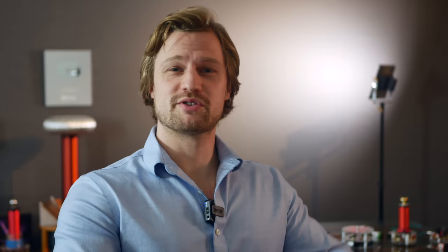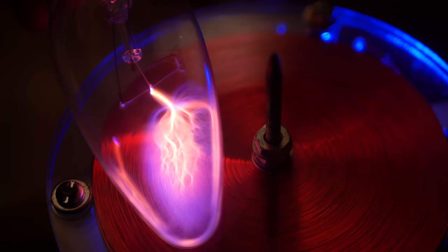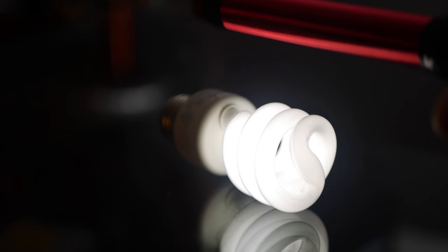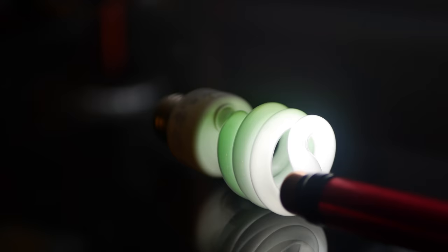Here's your 30 seconds of physics. With flowing electricity comes an electromagnetic field. This Slayer circuit turns itself on and off at a really fast rate — over one megahertz. That's over a million times a second it turns itself on and off. The secondary coil takes the 9 volts from the battery and boosts it up to several hundred volts. So that long secondary coil emits a strong electromagnetic field that oscillates at over a million times a second. Strong enough alternating electric fields will ionize pretty much all gases, whether it be the argon in this bulb, the xenon in this tube, the neon in this neon array, or in the case of a modern light bulb, the gas present in the fluorescent tube. When you see the lights turn on, that's an indication of invisible energy present — it's a brilliantly simple way to transmit power wirelessly over short distances.